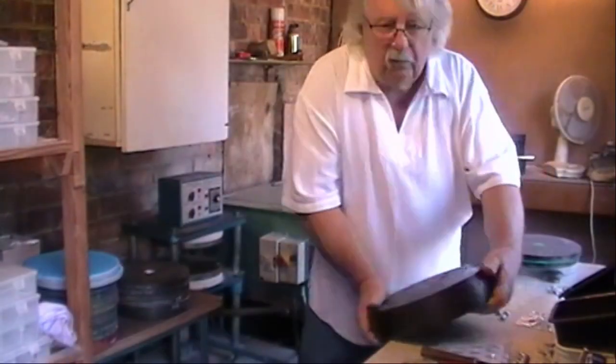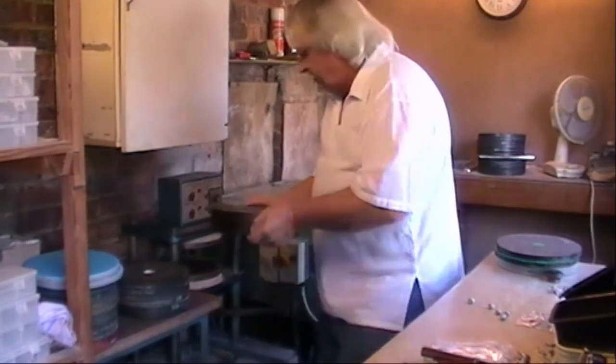So it's quite important that when you put the masters in the mould to start with, you make sure that you've got them in so that the metal will flow in once you've taken the patterns out when you start casting. So those are the two sorts of moulds, and they all go in the same platen in the same vulcanizing machine. So, pick the platen up.